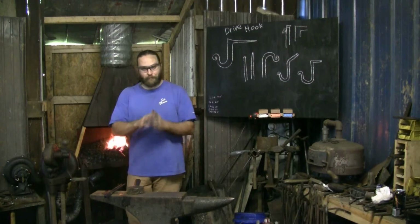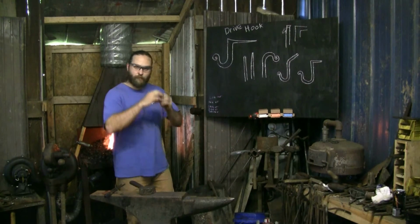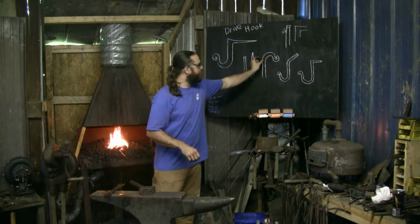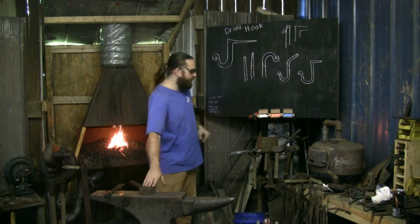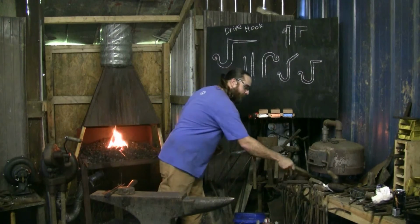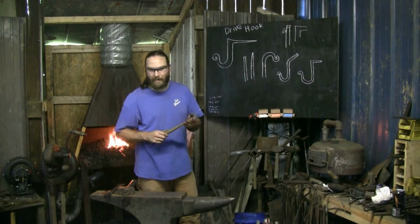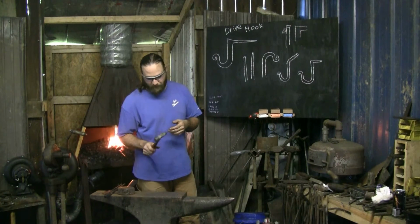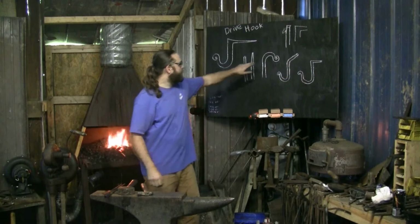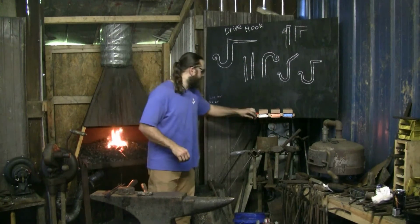All right, so I'm going to use two different hammers here. I'm going to use my heavier hammer for the thicker section of stock to make this end. This bigger piece of material that has to bend, I'll use the heavier hammer for that, but I'll use that second. First, I will go to a lighter hammer. This is maybe a pound and a half, if that. Just a little ball peen. I just want something lightweight because I'm going to work there at the tip to put this decorative curl that you've got on there.